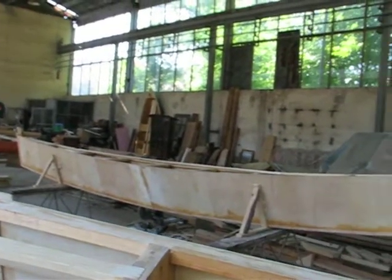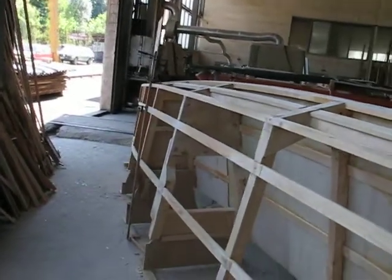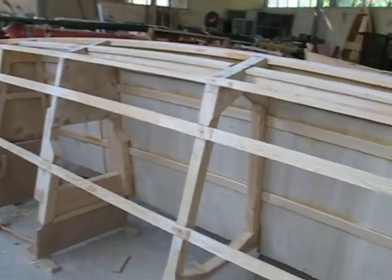The aka bulkhead is a massively built central bulkhead, same thing on the other side. 15 degrees deadrise, vaka length 23 foot, ama 15 foot, stitch and glue. The ama waterline beam-to-length ratio is 1 to 14.